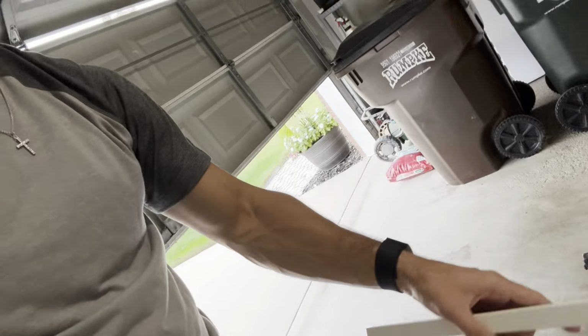All right, like I said before, for these spots where it's just exposed wood, there's no primer, you really should put some primer on there or else the paint might not grab good, might just kind of bleed through this wood coloring and really not adhere the way you want it to. So I'm just gonna put some of this Kilz. I'll just brush it on the edge pieces here and then on these sidewall supports as well. I'll put some where I had that exposed wood when I made those cuts. And then after that, we'll let it dry, and then we'll go on to painting it with the door and trim paint.